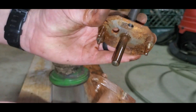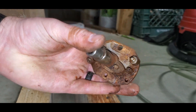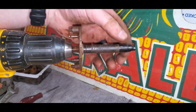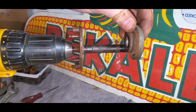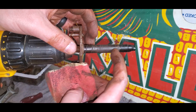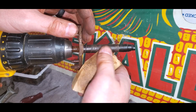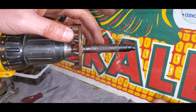The good thing is this right here is still good — that's not frozen. So I've got this chucked up here in my cordless drill and I put some tape over the end of this shaft where this coupling goes on nice and snug. What I'm gonna do is sand this down while the drill is on. If I had a lathe that'd be nice but I don't have one. I'm just gonna use some sandpaper and try to take the diameter of this down just a tiny bit so that it can ride smoothly.